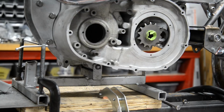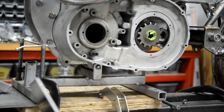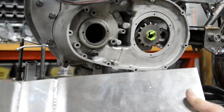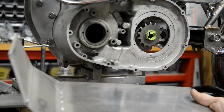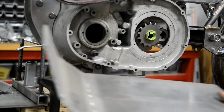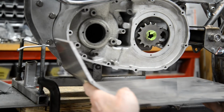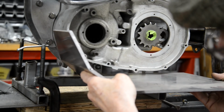Right, now I have here, this was going to go on the end, but I didn't put it on. It's quarter inch, actually it's really heavy, so we will cut some holes in the front. We won't cut any holes in the bottom, because apart from being protection, the skid plates allow you to slide over things. So the last thing you want if you're going over, say, a knobbly log, is to come to a hole where a knob goes up and catches. So that's going to go there like that.